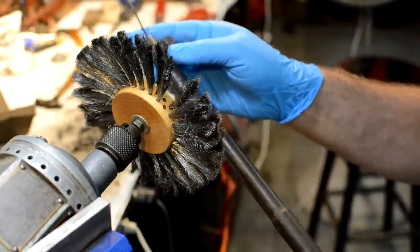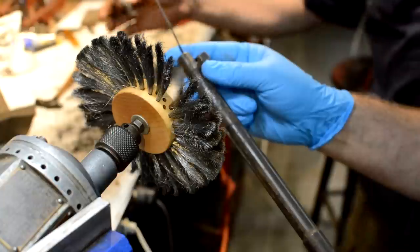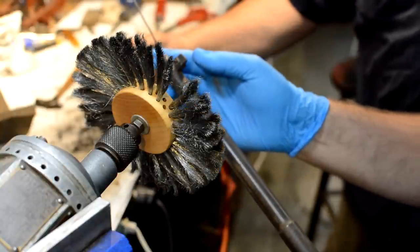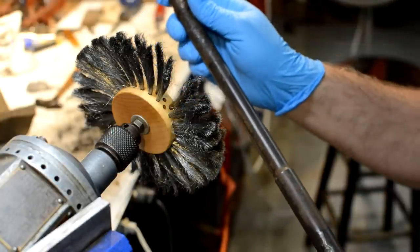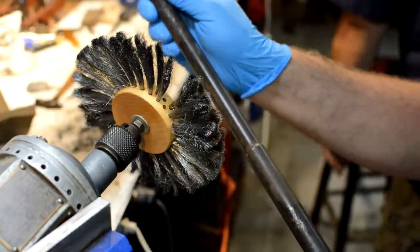And Bob, it's important to note that one of the places where contaminant comes from is oil placed on steel wool when it's inside its package. So if you use steel wool, and by all means use it, I would say like a 4-aught or maybe a 3-aught, put it in a small container, pour some acetone in it, and get all the oil off the wool first. That way you don't contaminate it with the very thing you're using for carding. That's an excellent point.